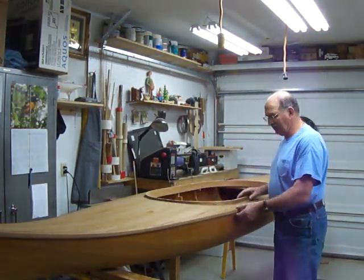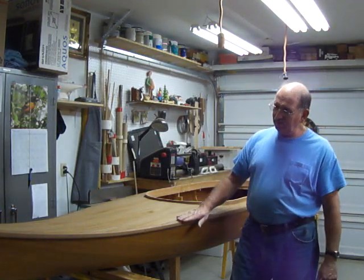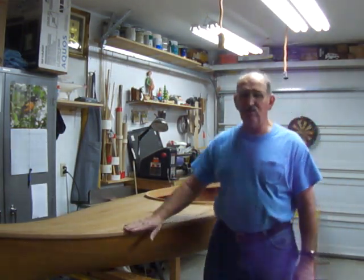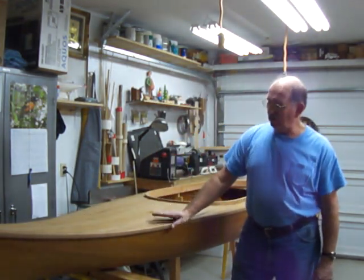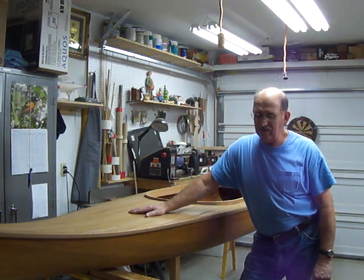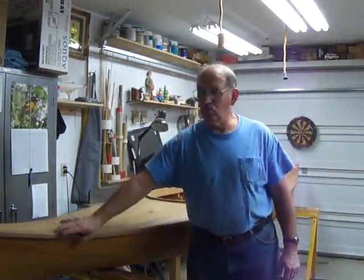I put my strip here — this measures about one inch wide by about three-quarter inch. As you know, I have a little flare here; it goes up, and I had to bend that. Cedar bends fairly easy, but it also splinters and breaks very easy. One of the things I did is I knew I'd probably have to steam it to get it to bend. Basically, I took a sponge in this area where I knew I was going to have to have my bend and twist.